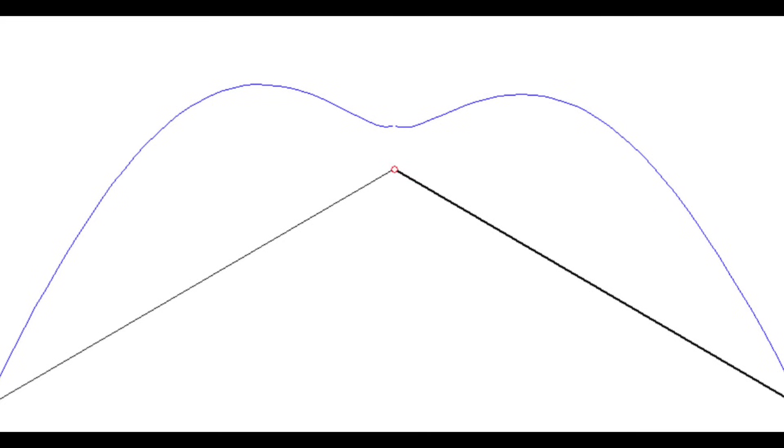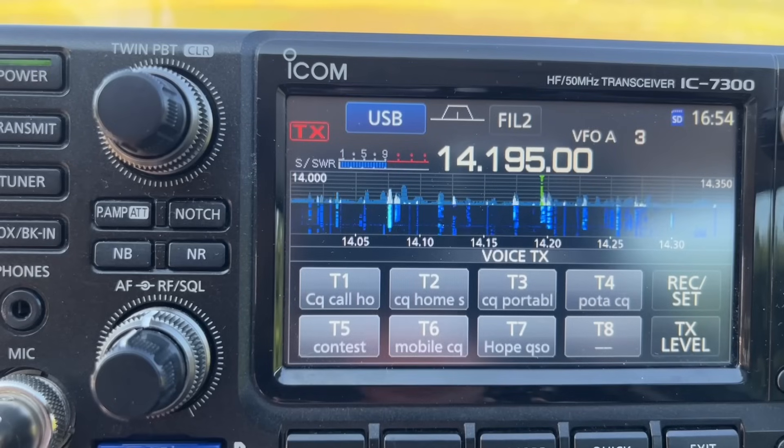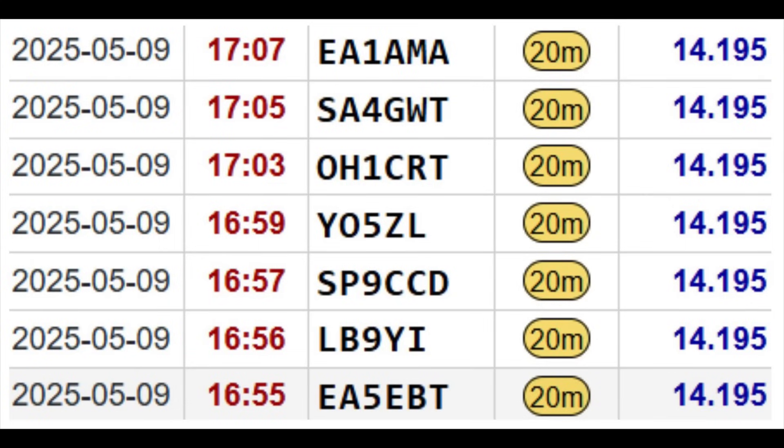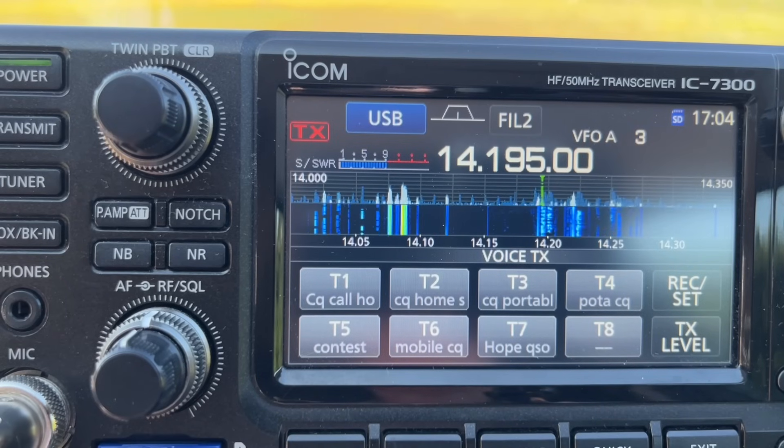Next, 20 meters. On 20 meters this antenna is a full wavelength long, so we have two main lobes. The antenna performed okay — it's not going to be massively strong as an omnidirectional antenna, giving a bit more gain broadside, a bit like a traditional dipole, but it's not quite high enough for that to be a particularly strong broadside lobe. Signals put out were pretty strong, with reports of 5x9 and 15 over 9 into Finland and 5x9 plus 10 into central Sweden.